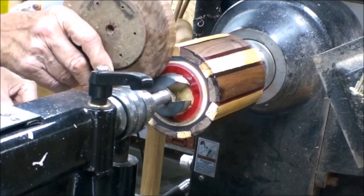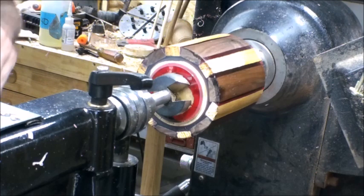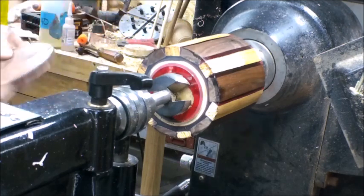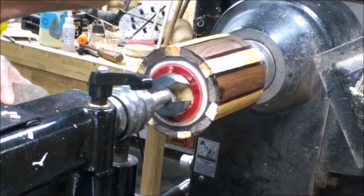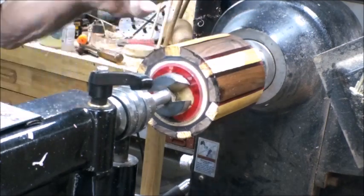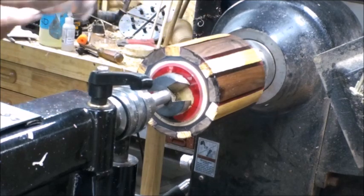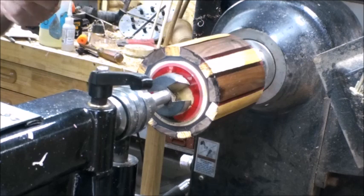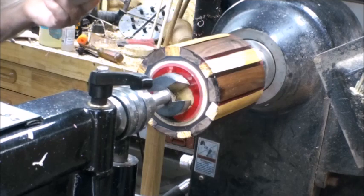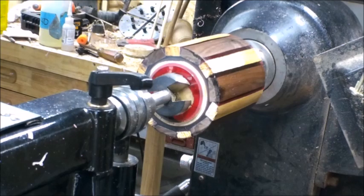And when it sets up, I'll flip it around, put the faceplate on this end, and then I'll hollow from the other end until they meet each other. Then here's the top already prepared, and it will be epoxied on the top. Then I'll drill my bird hole entrance and stuff like that. As far as these holes in here are concerned, I'll just sand this down on the sander, fill them with sawdust, and then disguise them with a wood burner or something. Make little flowers or something. Anyway, that's the way I do it.